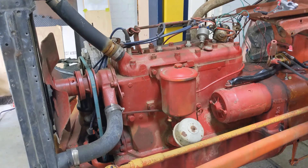I learned something today that I didn't set out to learn — it just happened. I guess I just didn't know much about starter motors. I didn't realize that these tractor starter motors are independent of polarity — they're going to go in the same direction regardless. I always assumed they were DC motors and that reversing the polarity would reverse direction. Now I can proceed with the rewiring project and I don't have to be concerned with it rotating in the wrong direction.